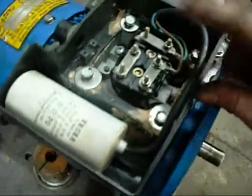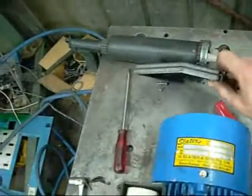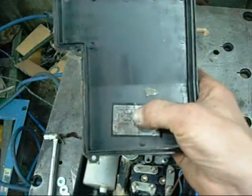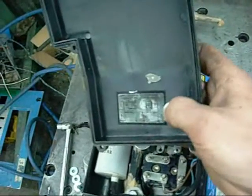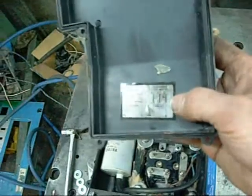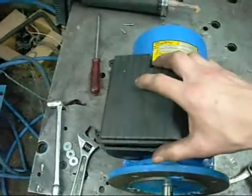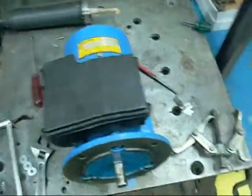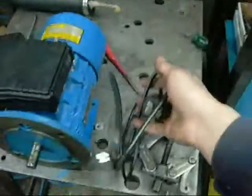I've restored a bit of structural integrity to the control box - the terminal box. I'm just using a bit of liquid nails and some screws, with big washers over the screws. That takes up the slack and keeps it there while the liquid nails goes off. It'll never be waterproof again, but it's not going outside - it's going to be used on a drill press, I think. Alright, let's set up for anti-clockwise run, but it can also be run in clockwise rotation. It's got a diagram there for it. Time to put a new power lead on it - I'll do that first.